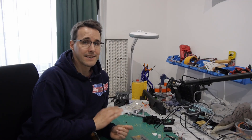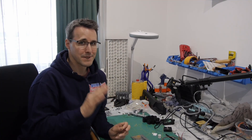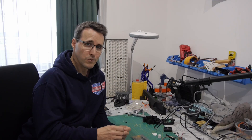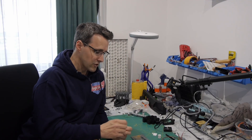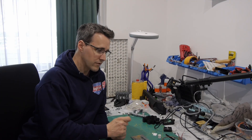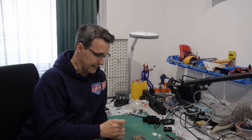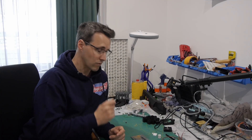You can buy them in bulk. Don't think those 1.8 millimeter LEDs you can also find will fit into the box — they won't. Believe me, I made that mistake. You can see the differences between the two LED types: the smaller one that we need has the legs going to the sides, and the bigger one has the legs underneath. The bigger one doesn't fit into the housing and you also risk breaking the LEDs when bending the legs. So just buy the smallest one and you're ready to go.